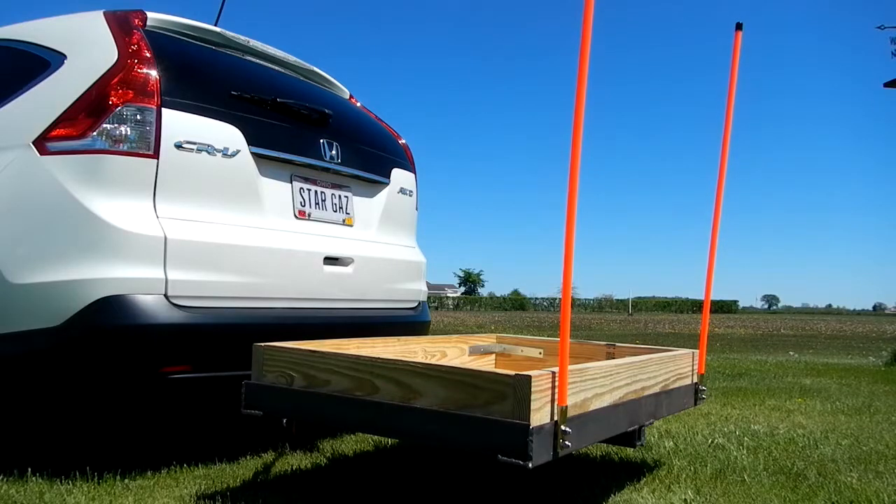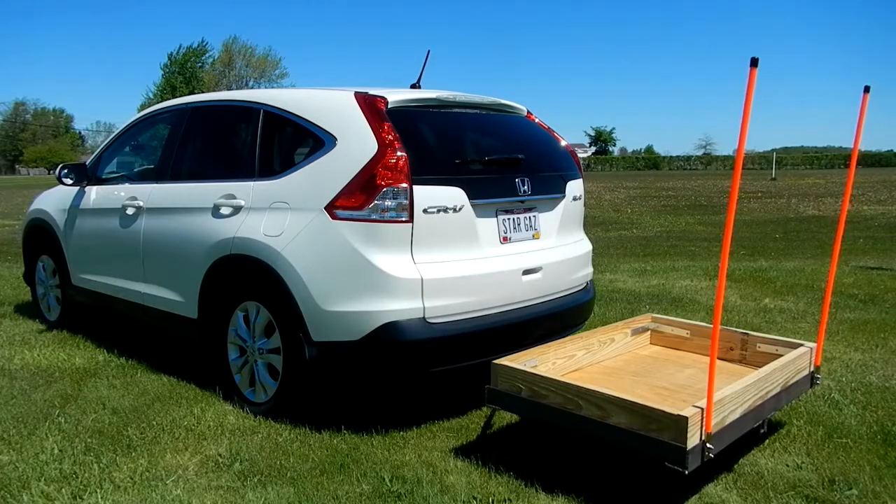Here's the insert ready to put whatever I want inside. Now all I've got to do is paint the carrier — I'm thinking orange or yellow — and I'm still going to put reflective stick tape on there, the kind you see on the side of semi trailers. I live in Ohio and I called the state troopers; the guy told me as long as it doesn't stick past four feet past your bumper you don't need lights. He said what I was doing was more than most people do. I'm under 48 inches so I'm okay. By putting those orange post markers and reflective tape around the back and sides, the unit should be easily seen.